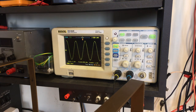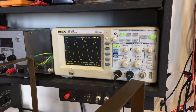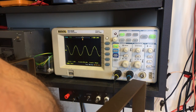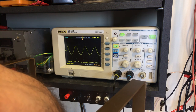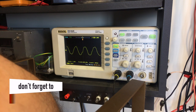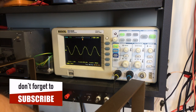Try the top one. Well, this thing's going up a lot. I'm going to add 6 dB of attenuation, so we're sitting with 18 dB of attenuation now. Try and peak it now. Now it's going down, so I must go back. That seems to be about it there. Let me try the other one, the other top one.